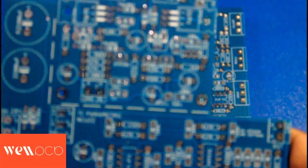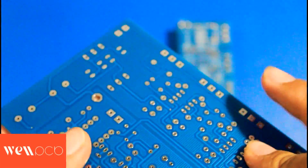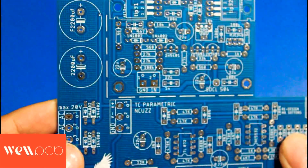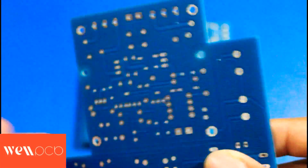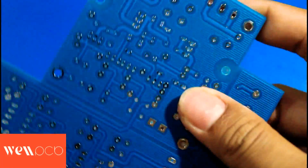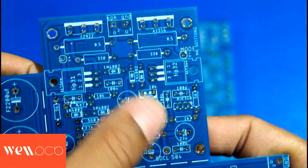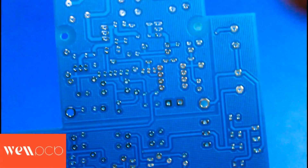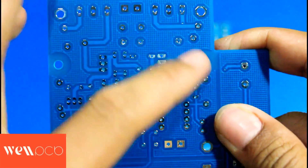Next is about the number of layers in the PCB. If you're having your PCB made at a factory, you would be losing out in my opinion if you only make a single layer PCB, because the price for one layer and two layers is the same. So here I tried to make a double-layer PCB. The bottom side has circuit tracks, and the top side also has tracks. By utilizing this double layer PCB, the layout you make will look simpler and neater.